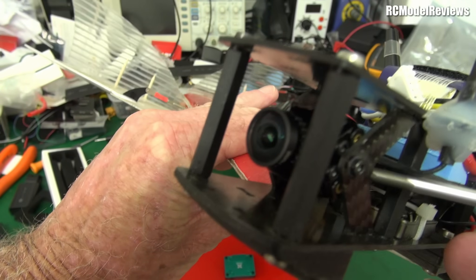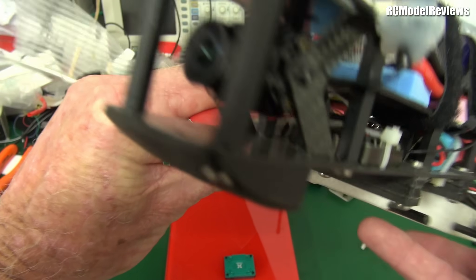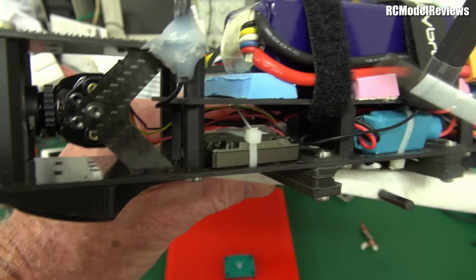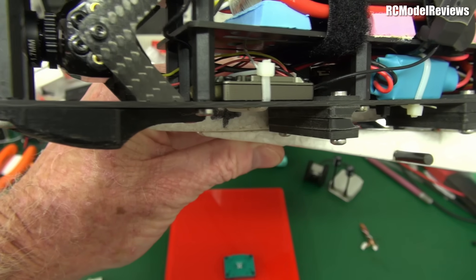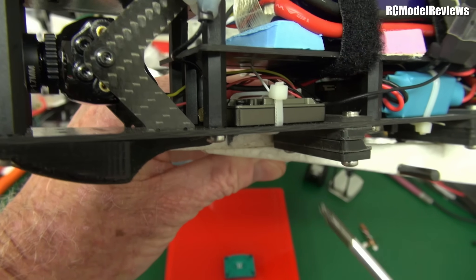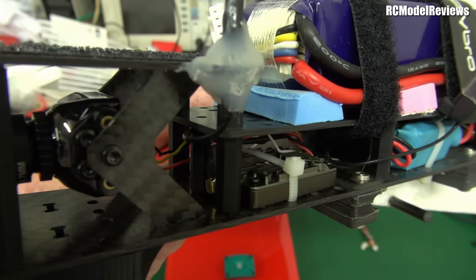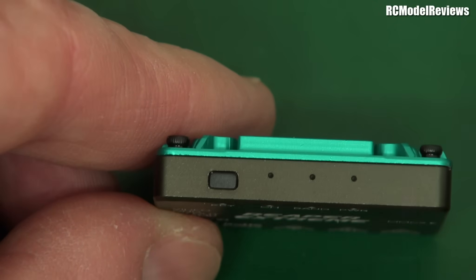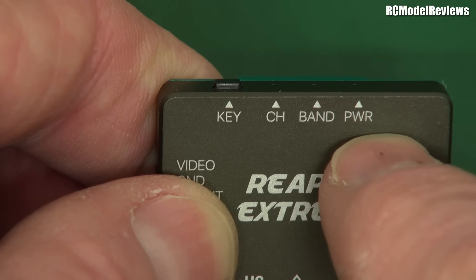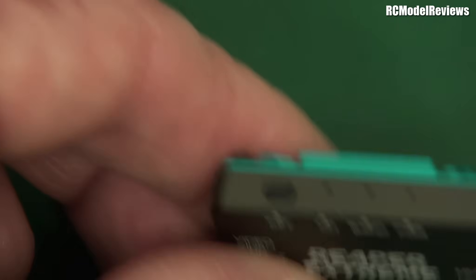There's the T-Rex camera — probably one of the best FPV analog cameras on the market. Ran the wires off to the battery — a four-cell pack — no flight controller, no OSD apart from the one built into the camera. I set this to 25 milliwatts, which will appear to operate as if it were 1.5 watts. Operation is simple: there's one button to cycle through settings, and lights showing channel, band, and power. No smart audio needed.